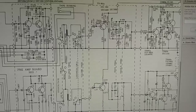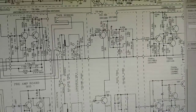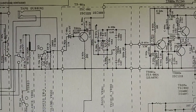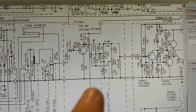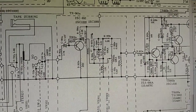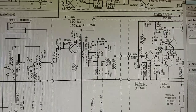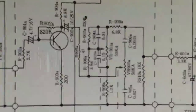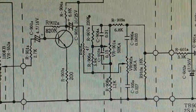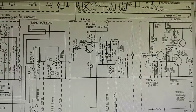There's less amplification. It's a very simple preamp - just one gain stage that they pump through a tone control set. This is super high gain and then they change the tone here. It doesn't seem to be affected by frequency response that much, so it would probably be a feedback issue. My suspect is the 10 microfarad at the output - that could be weak. The 4.7 at the input could be bad and loading it down. Let's find out which.